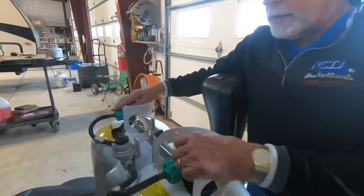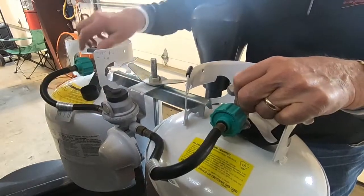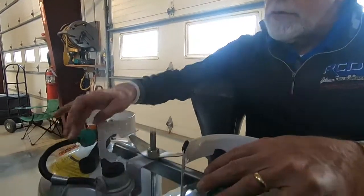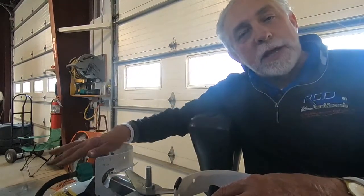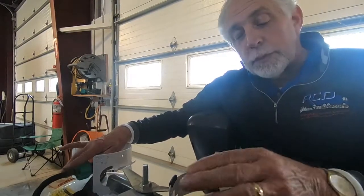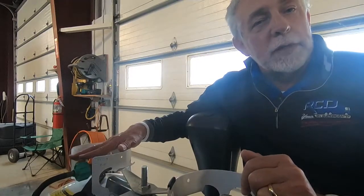You've got two 20-pound propane tanks — they're full. There's a regulator with a little arm on it. If both tanks are in the on position, it'll pull from whichever tank the arm is pointing to first. It will automatically switch to the other tank if one runs empty. I tell people to keep one turned off so that when it runs empty at 2 or 3 in the morning, you know you've got a full tank left and you need to get one replaced or refilled.